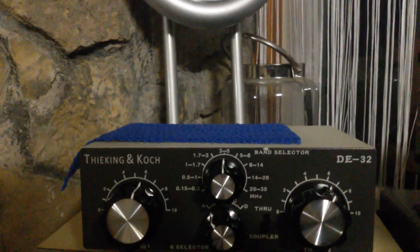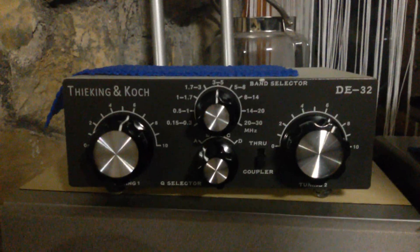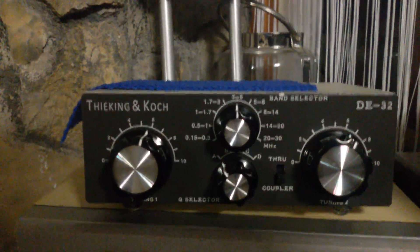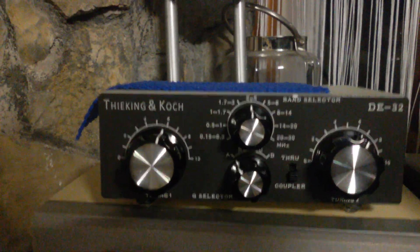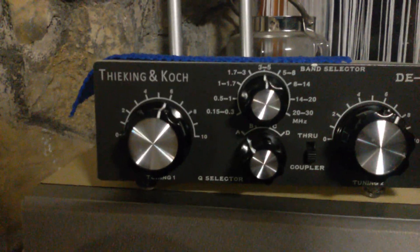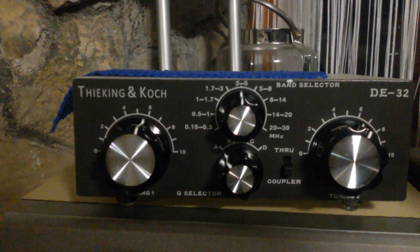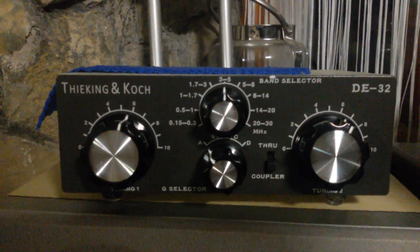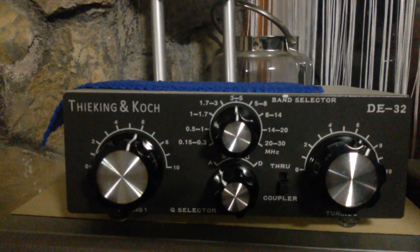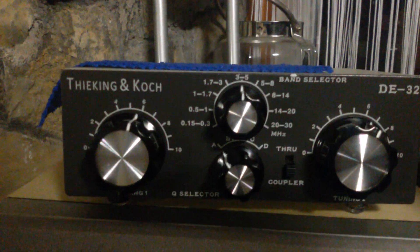I want to say something I've said before about antenna tuners: if you decide to buy a passive antenna tuner for shortwave listening, don't think it's going to make a great improvement because it won't. If you have a random wire antenna without an unbalanced feed, then the passive antenna tuner will work and help tune the antenna for the frequencies you want. But don't think it's going to be an end-all piece of equipment. If you have an un-un or a balun, you can hook your antenna up to this tuner and it's absolutely useless.